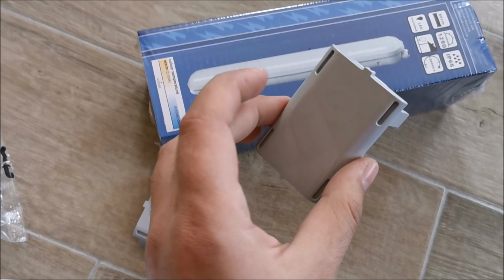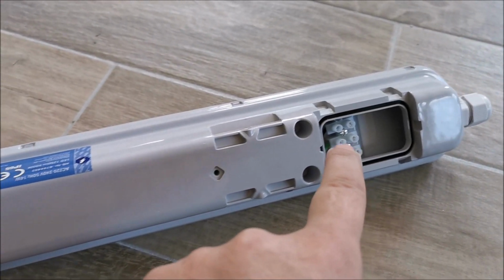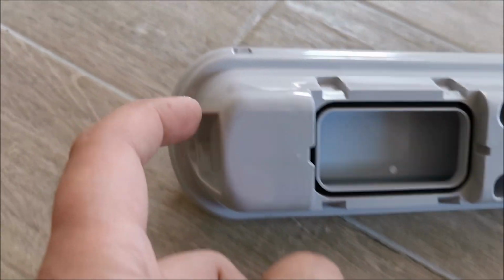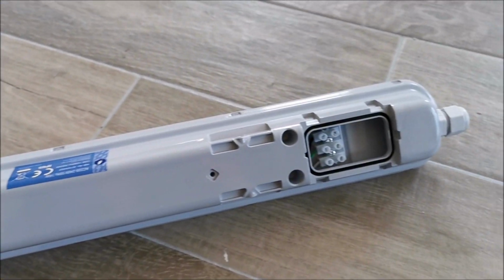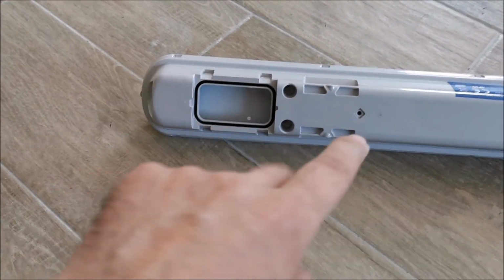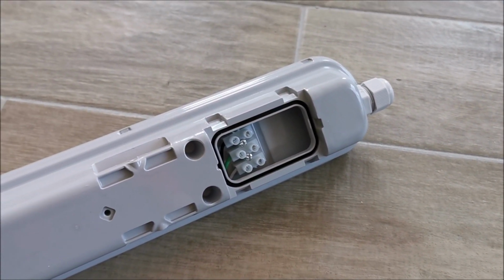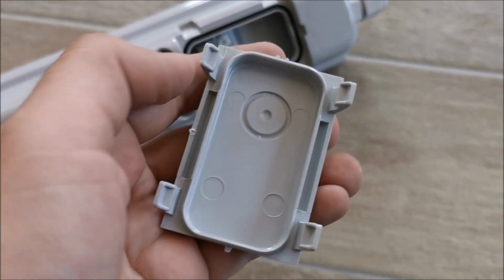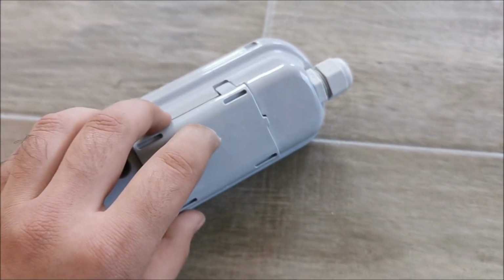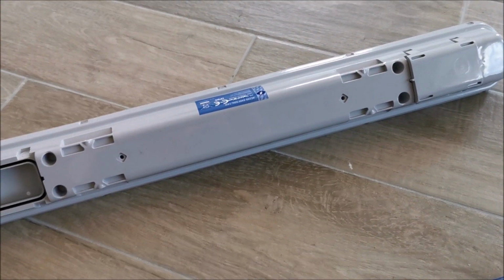And it's out, and I popped off the covers. Presumably they have models that can be daisy chained. This is why they have a second cover in here, but we have nothing in here, so this cannot be connected in series. The wire will be going in series from one to the other, but the electrical connection is actually in parallel. Anyway, I'm going to break this, and I will come out through the wall and connect to the second one on the other side of the cement wall to have light in the other part of the attic.